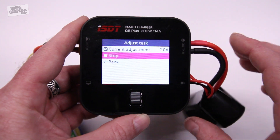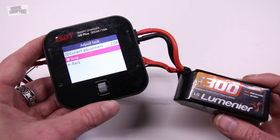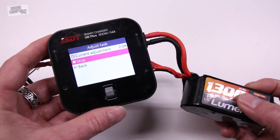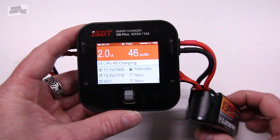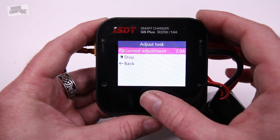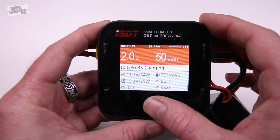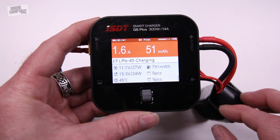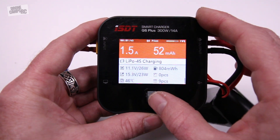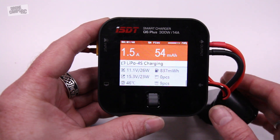Charging slower actually saves the longevity of your battery. If you do a lot of fast charging, you're actually going to decrease the lifespan of your LiPo. If you charge at a much lower rate — say you back it down to something like 1.5A — you're going to have a long battery life for this battery if you don't abuse it. Fast charging is kind of abusing your battery. I can also go back out of that menu.